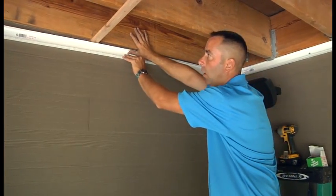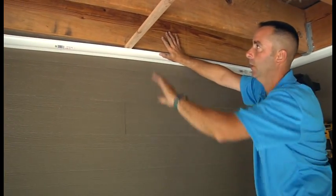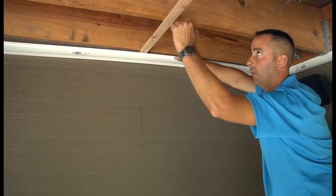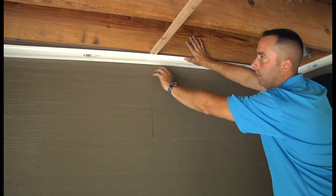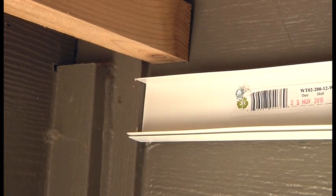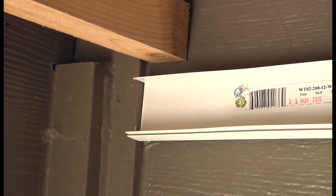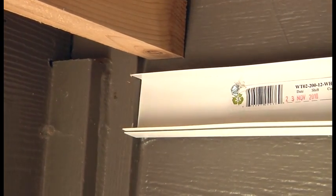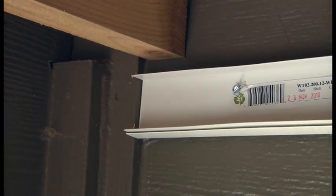When you're installing the side wall trim, you want to be sure that it's up tight to the pitch spacers so that it creates the proper slope. As you can see on the cement board siding, you can see the slope that goes down towards the eventual gutter that we'll be installing later. Be sure to leave a two inch gap away from the edge of your deck, which will allow for a gutter to be mounted up in there.